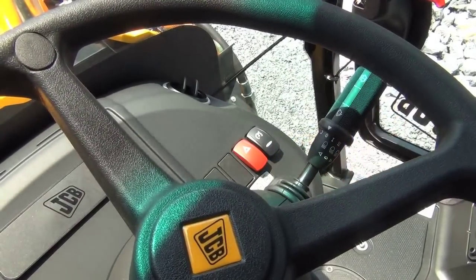We also have front cruise control — once you're loading the machine you can click it just like in your car and it'll stay at a predetermined RPM. We also have the throttle lock, a really nice feature. It saves you from constantly adjusting your throttle when you're digging. Once you start running your excavator, it'll automatically remember your throttle, so you won't have to worry about it standing at that RPM the whole time when you're in the front position.